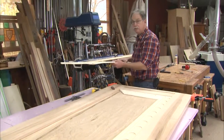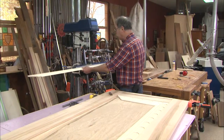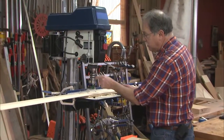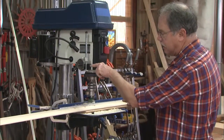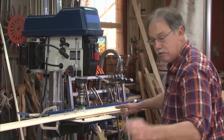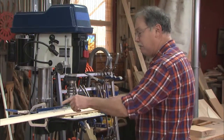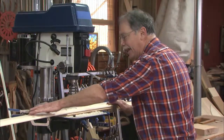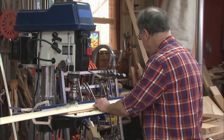Be sure to watch the show at the American Woodshop, wbgu.org/American Woodshop. Now to drill those rosettes, I'm using a fence and a rosette cutter at the right speed, and a stop. To space them, I'm using the proper piece of wood — I did the math, and along a 67-inch back edge I'm going to have a total of 17 rosettes.